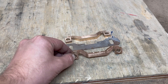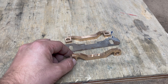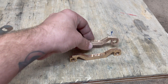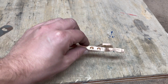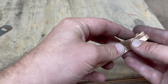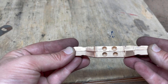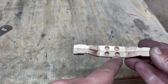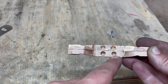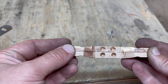I drilled and reamed these axle boxes 5/16th of an inch, which is how big they are, and I'm a little bit upset because if I get them back to back — I had them pretty well aligned in terms of dimensions, and then the first mistake was I didn't pay too much attention here and I let the drill wander. I did spot drill it but not deep enough and it's slightly out.